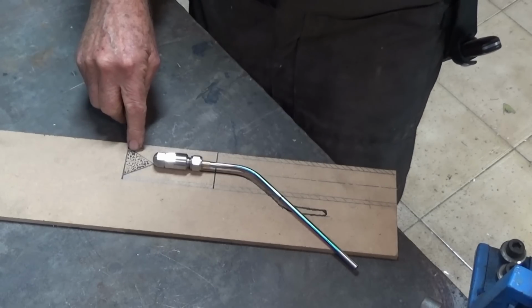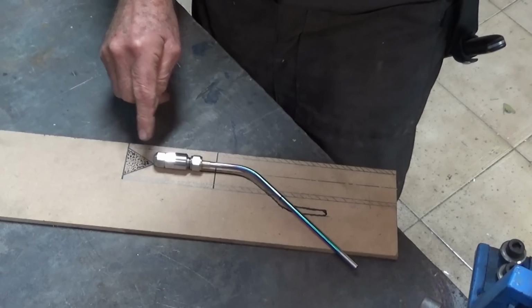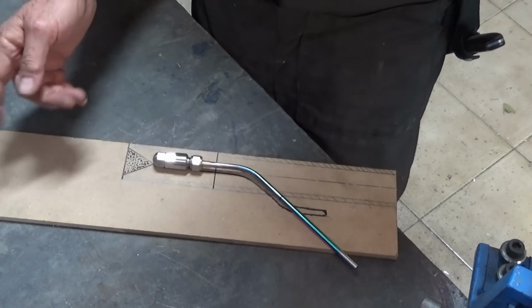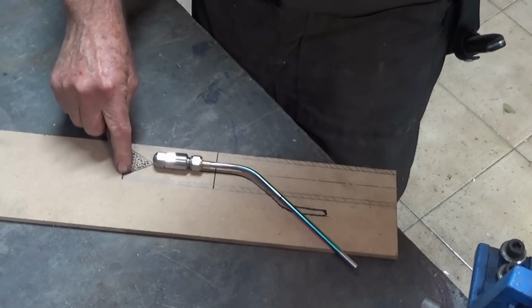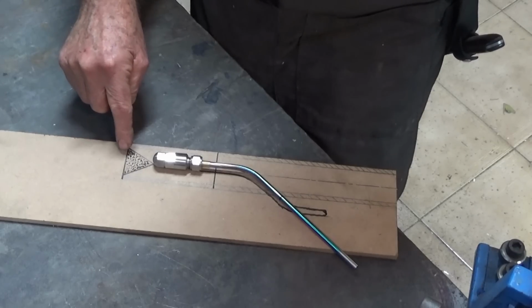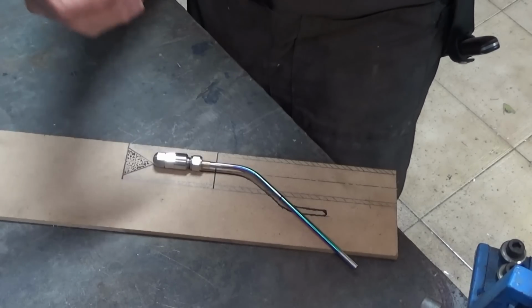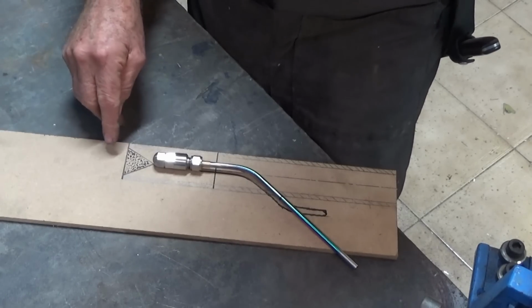Now at the front here, I've drawn in the 60 degree spray pattern that this burner nozzle can produce. And sort of what you want is you want to have that spray pattern fill the end of the burner tube. If it touches the edges of the tube, it will sort of condense into a liquid and dribble down the inside of the furnace and make a mess.